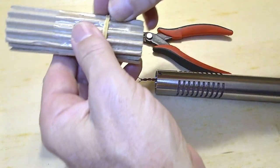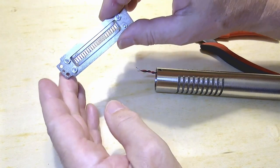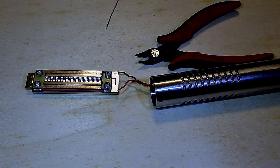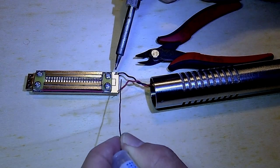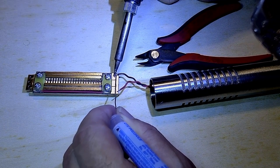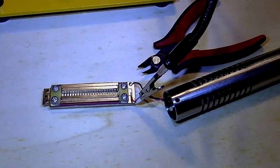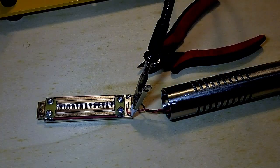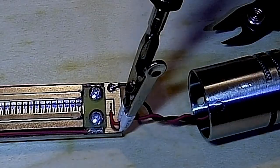I carefully unwrapped the ribbon motor, making sure there were no metal parts and small tools around. And soldered the red and black transformer input wires to the terminals on the bottom pad of the motor. This was the most difficult part of this entire assembly for me. Especially when soldering the red wire to its terminal. There's only a fine area that is etched away separating the terminal. I used a much thinner solder and was very careful not to bridge the tiny gap.